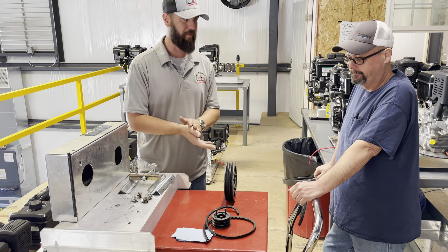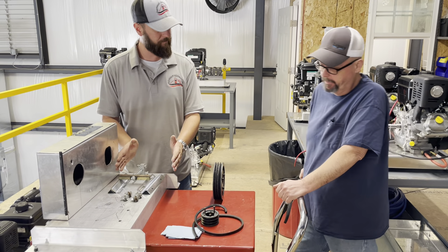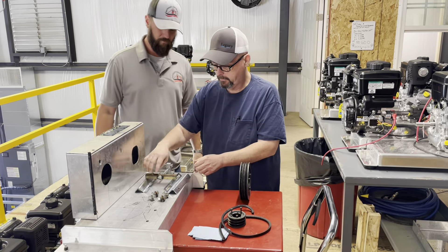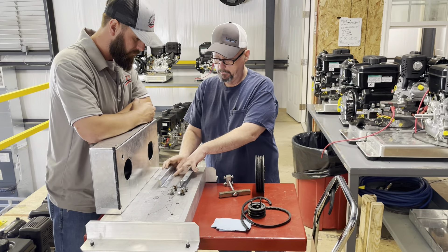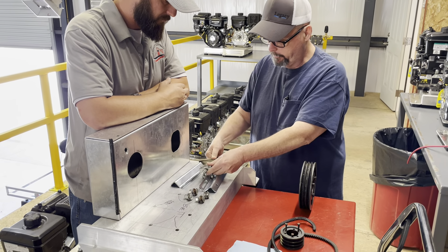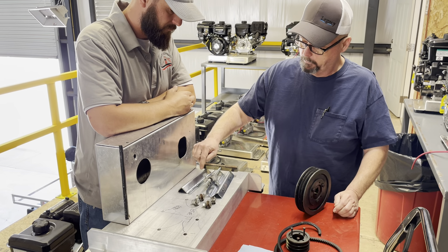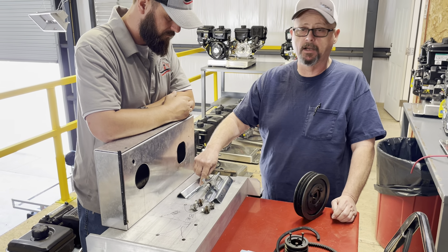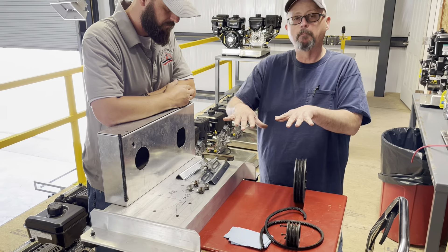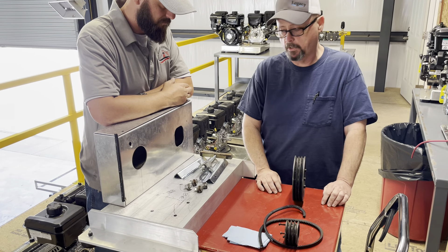Looking at the motor shroud — your pump would be here, your engine mounted down here. The rails are what mount your pump, and there's an apparatus under the pump or frame to tension the belt. When tensioning, it's a really good idea to use a straight edge to make sure your belts are staying in line as you tighten. Some setups may pull to one side slightly, so double-check your pulleys with a straight edge.